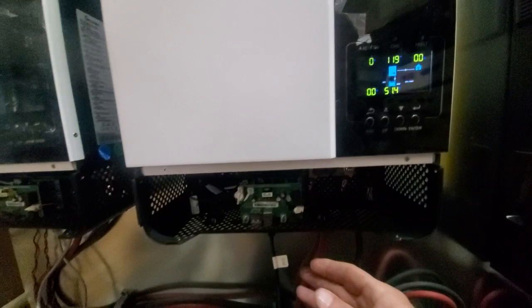There we go — 120 volts. AGM battery type is pretty safe; it's not going to overcharge the battery. But we have this BMS communication port. The concern with AGM battery style is we're setting our charge amps to 60 amps. Watch what happens when we plug the communication cable in — it goes down to 20 amps.